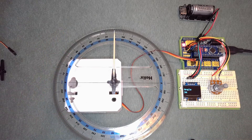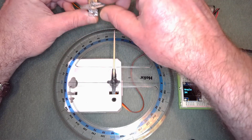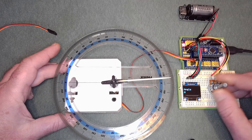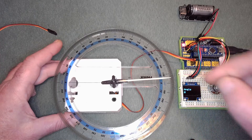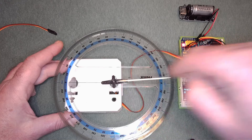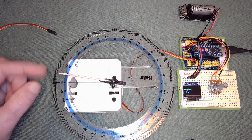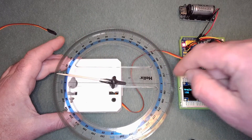From this we can also see we've got a bit of a false sense of security with these horns. When we rotate and think we can get more than 180 degrees — physically you can, but you can't when writing to the servo. Taking it down to zero: with the potentiometer at full lock one way, the minimum angle is 4 degrees — it doesn't reach 0. In the other direction, at 180 degrees commanded, it only reaches 172 degrees, about 8 degrees short.